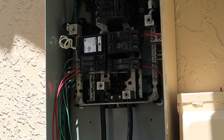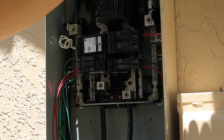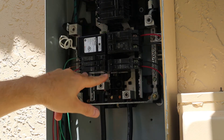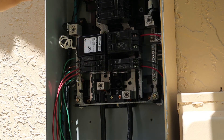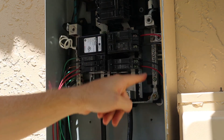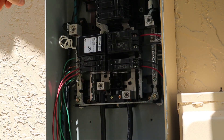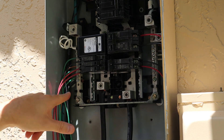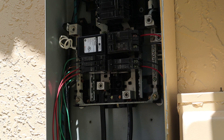Just for a quick tour for those not familiar with electricity: power comes in through the meter through L1 and L2, and a neutral comes in here. Those two feed the main. Each one of those vertical bars — called bus bars — feeds power to the breakers. In your main panel, your neutral bus with the white wires is tied electrically via a bond jumper to the ground bus. These legs down here go to a sub-panel to feed the rest of my house — I believe they refer to this as a feed-through panel, because it takes power in and can feed another panel with feed-through lugs.